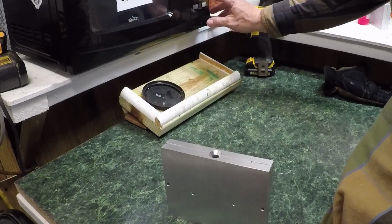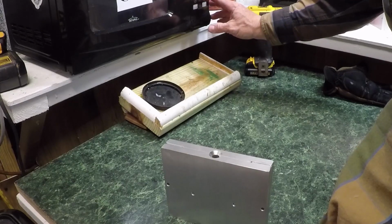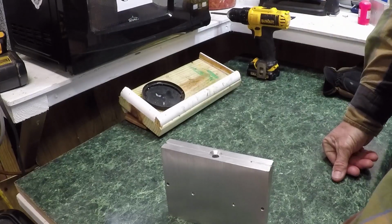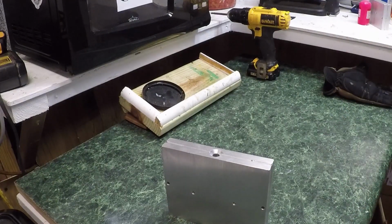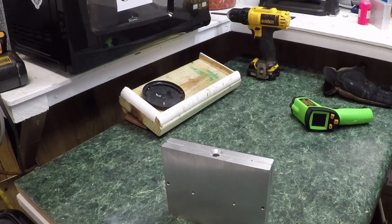So, we're going to have to run it longer then. I usually run it for 1:50, but we're going to run it for 2:30 to start off with. You're better off to go back and check it and add 30 seconds, or you ought to burn your plastic. That's 16 ounces, and if you burn up 16 ounces of plastic, you done wasted some money. So, check it every once in a while and do 30 seconds, and then once you get close, do 20 seconds or 15 seconds.